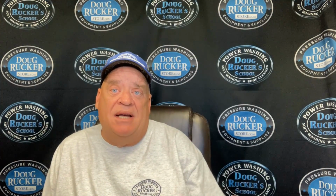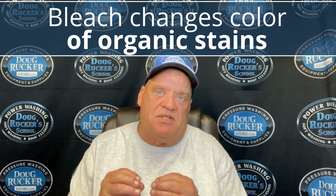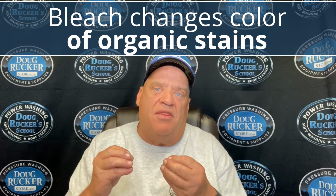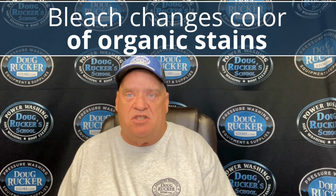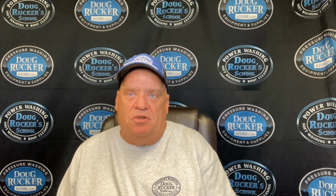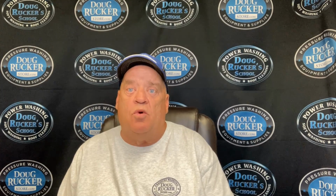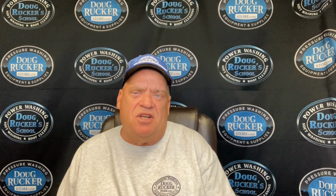Now, oftentimes, like cleaning brick, I'll use a downstream injector because I know with brick, I still have to use a little bit of what I call encouragement, light pressure, to remove those organic stains. Because when you get down to it, all that's happening is that the bleach in your mix is changing the color of those organic stains if the bleach mix is strong enough. Sometimes on downstream injection, if you've got black mildew, the bleach may not be delivered at a strong enough ratio to have that color change.